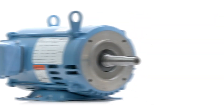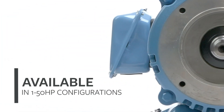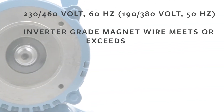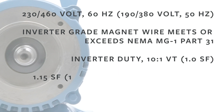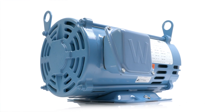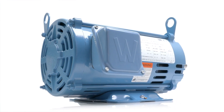These motors operate at premium efficiency specifications. They are available from 1 to 50 horsepower, 60 hertz configurations, meet NEMA specifications, and provide inverter duty suitable for ODP motor applications. Their service factor ratings allow for intermittent overload capability and additional power output for heavy or rugged loads.